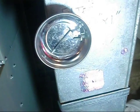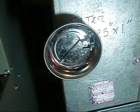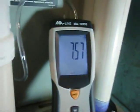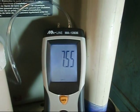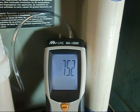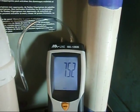I've got the little screw out of the gas valve. Glad I got this little magnet tray from Harbor Freight — saved my butt from losing stuff. Got the manometer hooked up, ready to rock. We have the gas off — now let's go with the gas on. Should be around seven. You can perform this test with the furnace off; we're just checking the gas pressure coming in. Hell, I think we're pretty good. I am digging this manometer. Let's try another test. We concluded our inlet gas pressure test — came up around seven, that's what we were looking for.